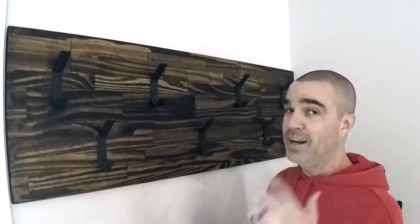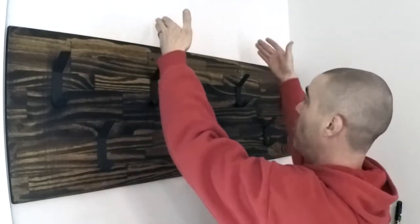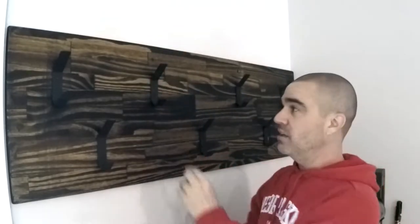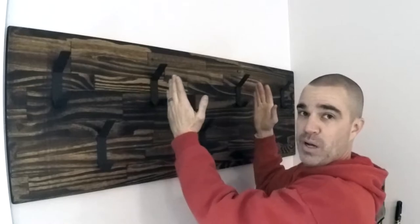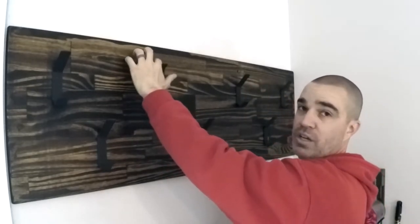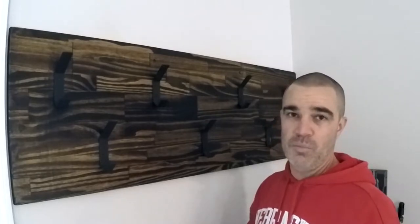Something I wish I had done — I didn't measure this out ahead of time — but the actual studs for this wall are just a little bit off from where I put the hooks. Had I known that, I would have measured 16 inches exactly on center and been able to adjust things to screw right through without putting an additional screw up top. Overall, very happy with the project. Got about $30 into the whole thing, and if you were to buy this off the shelf it would cost probably three times that. It took about three hours of total work time — there's a lot of dry time between coats of stain and the layers of linseed oil. Setting up the video and filming made it take a lot longer than it actually would have. Thank you for watching and we'll see you next time.